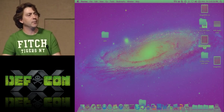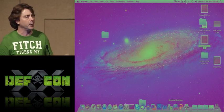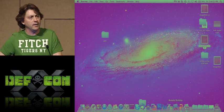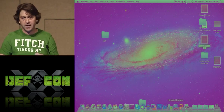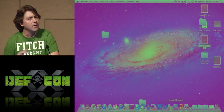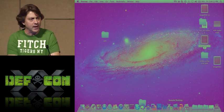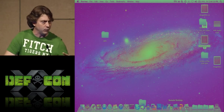No, but that is why I believe XOR2 is in place. There were more things I could have shown you on that layout that I just had open, because they do some wild things with what I call XOR3 and XOR4, and they have the same key bit material coming into them, and they're individually selectable to be turned off. And I believe that that's for DPA. So that main common bus is randomized every reset.